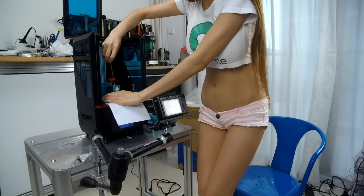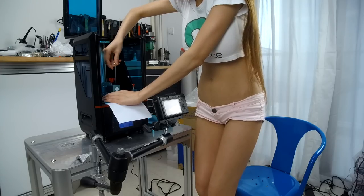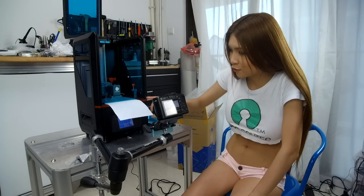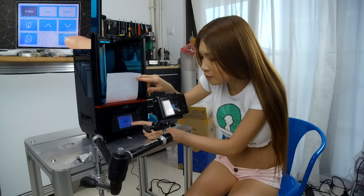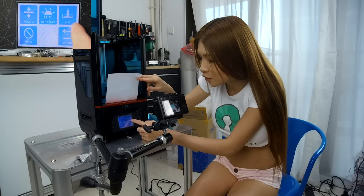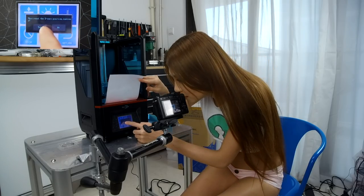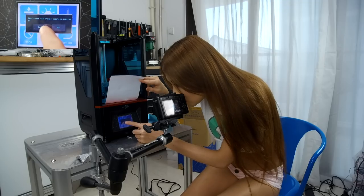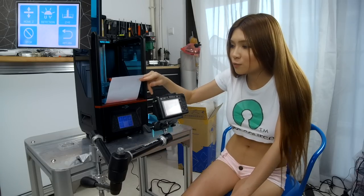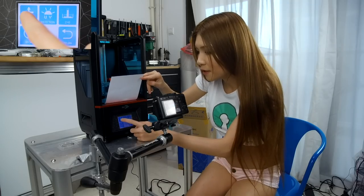There is an inserted screw inside, we need to tighten it. Put your hands on the build plate and let the build plate lay flat on the LCD screen, then tighten it. I think it's done. So now let's go back to the previous menu and press Z equal to 0. This resets the Z=0 position — continue, yes. So every time you try to print it always starts from this position. Let's move it back up again.